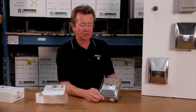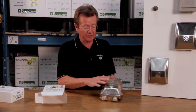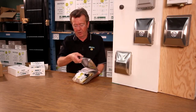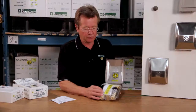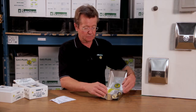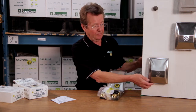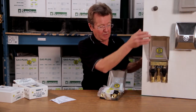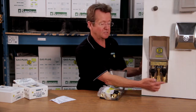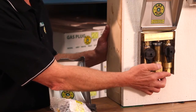When you first take it out, you want to make sure there's no damage on it. Sometimes damage will appear on the box, or on the unit itself but not the box — if it's on the box you need to be cautious about the inside. You'll notice the instructions as well as a warning tape across the packing. That warning tape is meant so that the person doing the install doesn't leave the plug in, for safety reasons, because with that plug in the gas will flow.